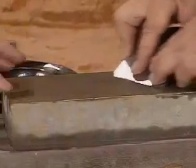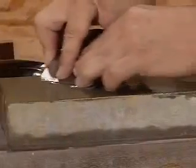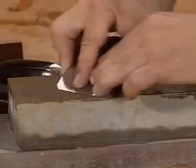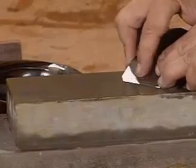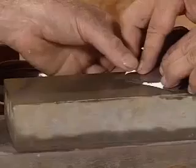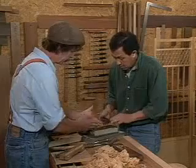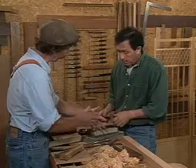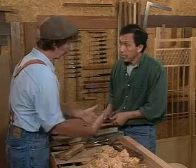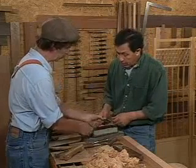Wow, what a special stone! And I see how you're very carefully working over it with those short strokes, working the whole surface. The stone, and trying to keep the stone flat. You can see it almost sticks. It's so flat, it almost sticks. Good heavens, to the vacuum. Yeah. Wow. Now, John, what I would do is I'll get out to a burr. I'm sorry, just bad sharpening habits. I will let a wire edge come out, and then I'll say, okay, I'm going to just kind of stroke that off. But that's the wrong thing to do, you say. Right.